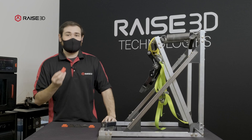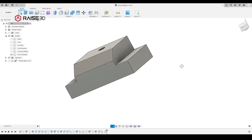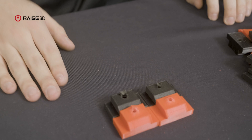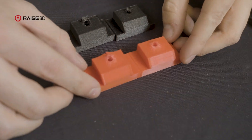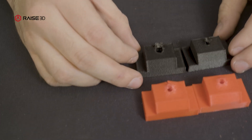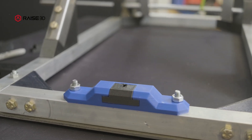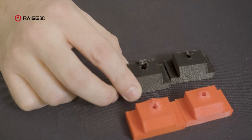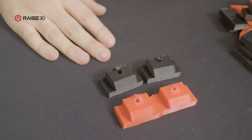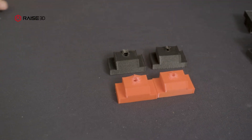The last ones have no inserts or nuts at all — the threads are printed directly into the part, modeled right into the STL file. These are my personal favorite and they stood surprisingly well. The PLA ones came in at about 67 pounds before breaking. The carbon fiber nylon ones with printed threads did the absolute best out of all these tests, getting up to about 112 pounds before breaking — completely stripping out all the threads when they finally gave way.